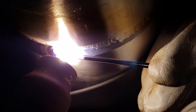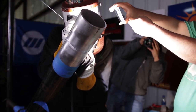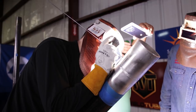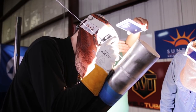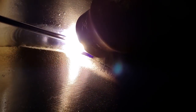I am using a lanthanated tungsten for the root pass, prepped to a sharp point, which allows me to focus solely upon the bevel tips for more precise control. However, pure tungsten will ball and allow for more surface area, so the tungsten can be held in the middle of the gap — with its ball shape it will have better cleaning action and also be able to melt both bevel tips. Though personal preference and practice, I like the sharp point. The same settings on the machine would actually ball up pure tungsten if sharpened to a point, while it does not do so with the lanthanated.